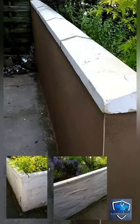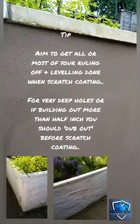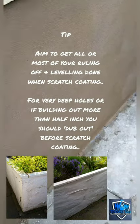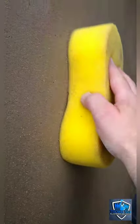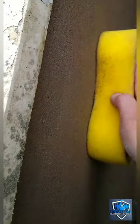Chuck your scratch on, try and get all your ruling up and straight edge work done on your scratch coat. Spend the time on your scratch and get it ninety percent right — not too many bellies. Don't use your top coat for building out too much, because when you come to rub up you'll have thin spots and thicker spots and it'll go off inconsistently. Sometimes it can't be helped and you do end up having to use your top coat for building out deep spots, but if you can, get a bit of fibreglass mesh into your scratch coat so you can go a little bit thicker.